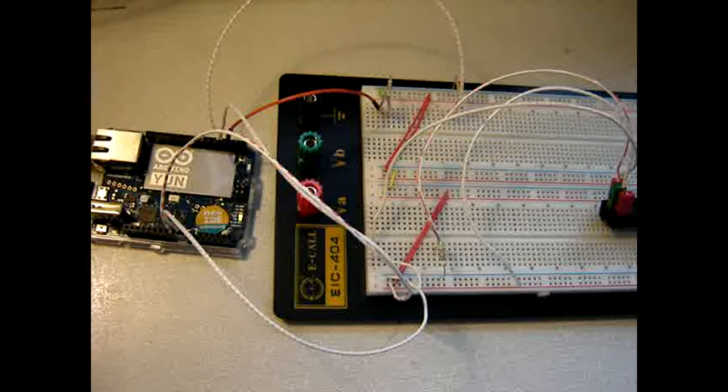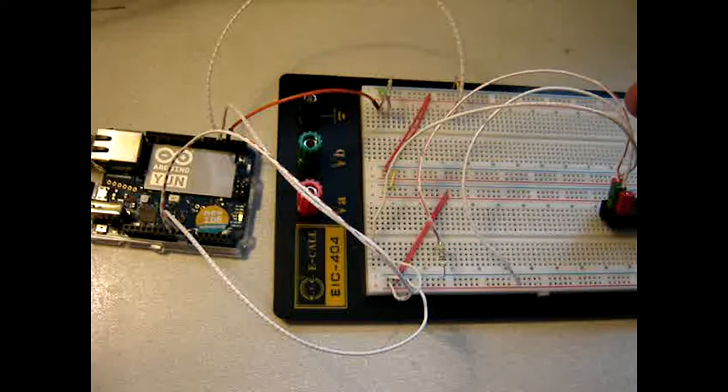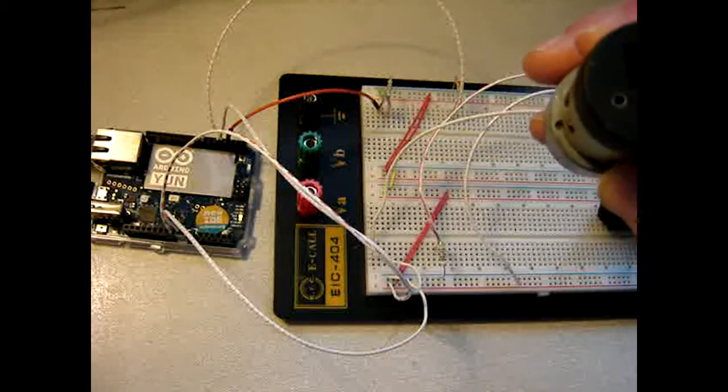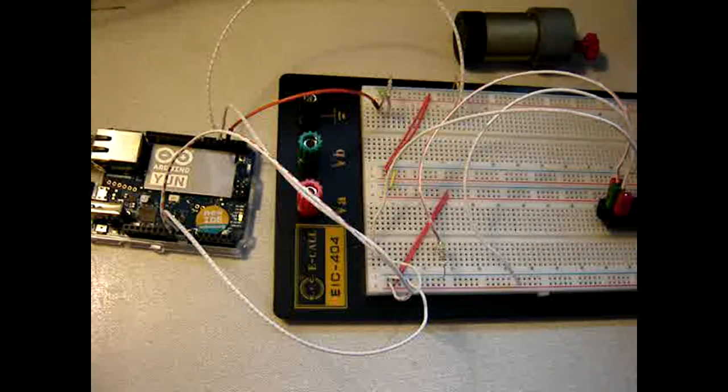So what I want to do is first replace that LED and then see if even that one or also that one works. When that is done, I want to actually introduce this motor and see if I can make this one work by pressing the switch. And that will be a nice challenge, because for that I need a transistor probably, and another resistor, and then see whatever happens after that.